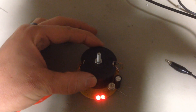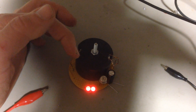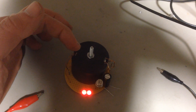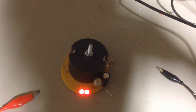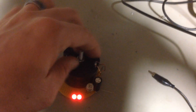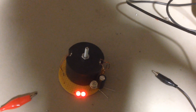The winding ratio is a little different. I could take one of these apart and explain that in the future. I've got two or maybe three layers on the primary, and then I was just really filling up the secondary with 28-gauge wire and actually ran out of wire, so I stopped the winding at the point I ran out. I'm surprised this is still continuing to go after connecting between this wire and the case and doing such a bright run — this thing just runs on and on.